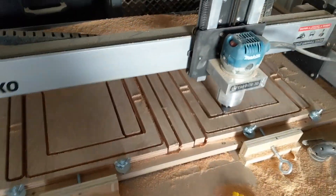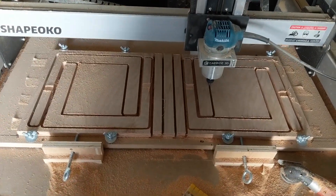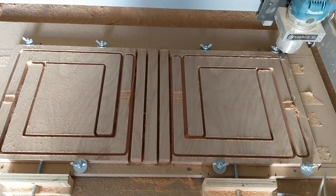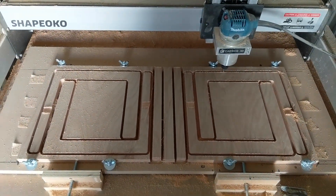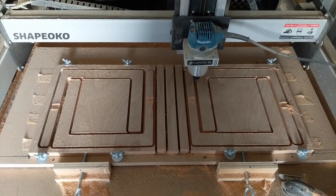The clamps are simply bolts inserted through a piece of MDF. You drill the holes a little smaller than the bolts and stick them through so it's nice and secure and the bolts don't turn when you clamp it down. I like to use the additional MDF because it's easy to replace and it keeps the stock surface from getting all cut up.